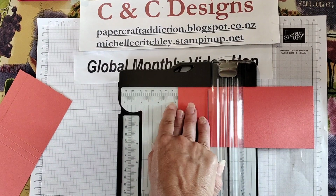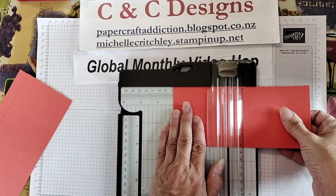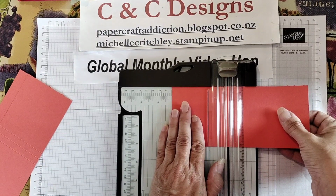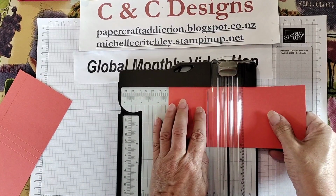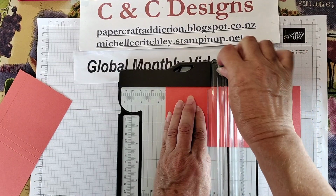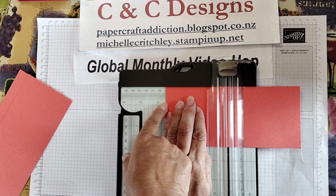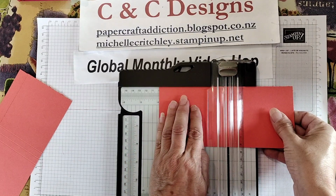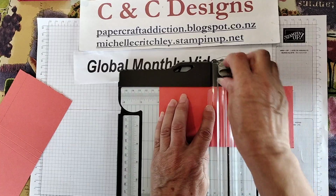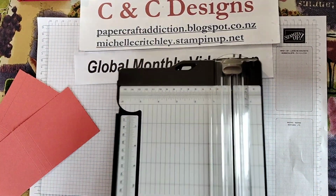So with the 3, I'm going 2 lines over to 3 1/8, because the first line is 1/16, and then it's 1/8. Okay, and then I'm going to 3 1/2, and then 3 7/8. So I know a 1/2 is 4/8, so then count 5/8, 6/8, 7/8. There we go. All right, so those are all scored.